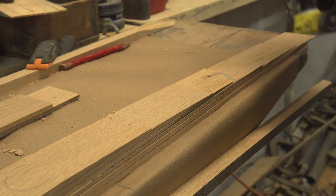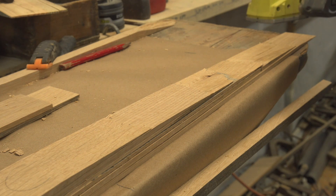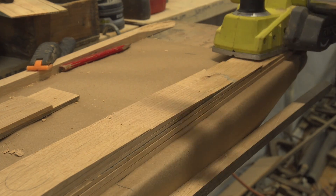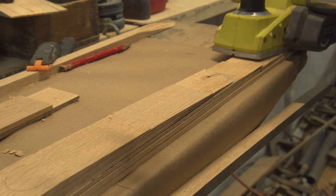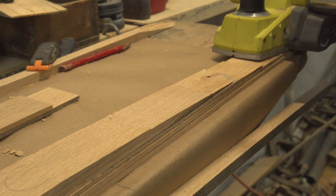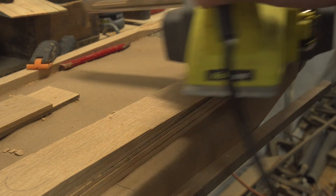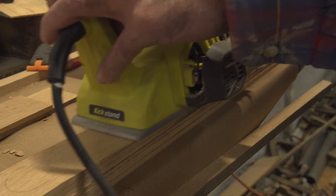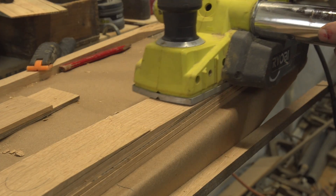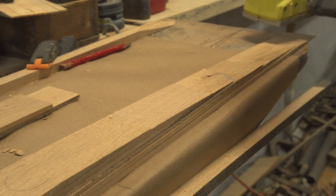What I'm doing here that's kind of different is I'm using the planer backwards when making a scarf like this. If you try to go the normal way you'll just keep catching on the ends of the laminates and disintegrating them. If you turn the plane around backwards, you're kind of planing downhill with the blades, and it just works fantastic — it comes out smoother, neater, and it's easier.